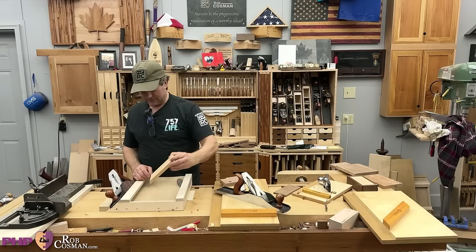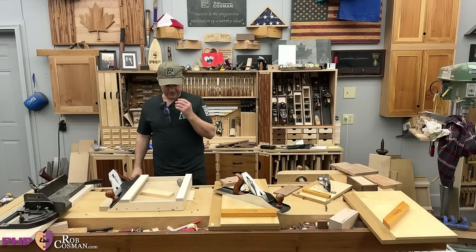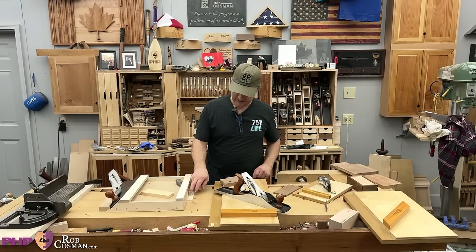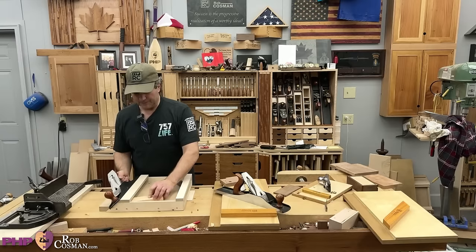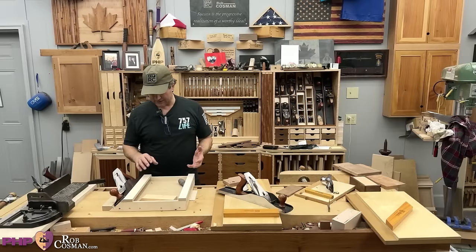and that's not unusual. If I was doing a chest of drawers, and the chest stood 40 inches high out of solid wood and I'm trying to miter it, if I did it in here, I could put it in, I could pad out this side of my bench by that same thickness, put the board in there, and I can go ahead and plane it without a problem. But to try to have something 40 inches sticking up in the air like that, I would do the plane. And the nice thing about this, once you make one, if I need it to be wider, it's easy enough to make. It's not that difficult.